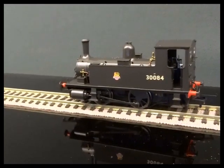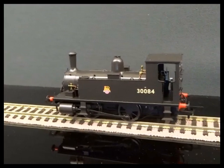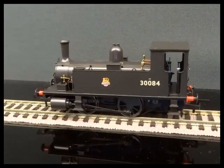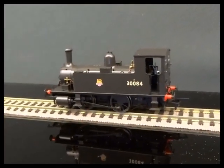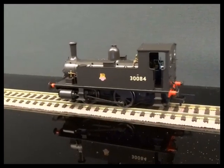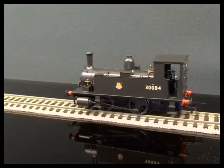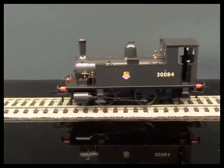I've got the loco on the track. What I tend to do before giving it full power is check it out on the programming track first — that will give you an indication if you've put it in upside down so you can correct that. It's also worth going into CV30 and reading the error code; you want to see a zero. It's not so important for a loco with a plug-in chip, but it's just nice to check everything is fine.